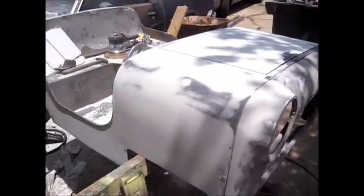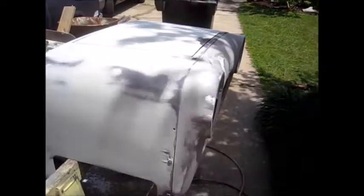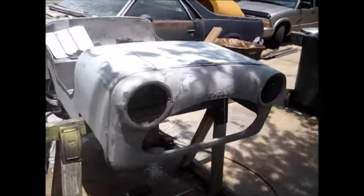The whole thing is coming along. This side is about 90% finished. Now right here I've got to take this screw out and then block all this. I had to leave this in here until I get it to hold it all together. But each one of those bolts will come out, and then I'll block. I'll put a bolt in here, then I'll block sand that part and level it the same as I do all the way across here. It has to be bolted together with these bolts. I'm using stainless bolts in every one of these, with a little small washer.